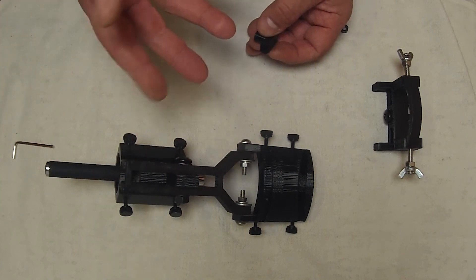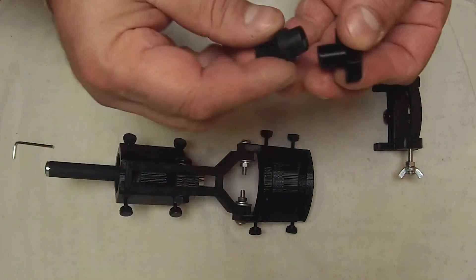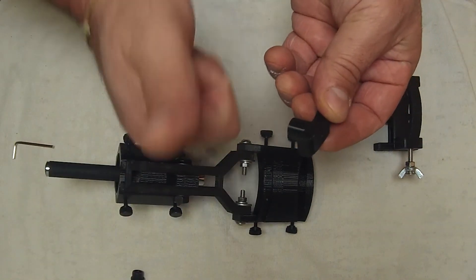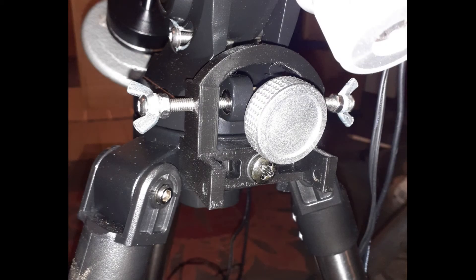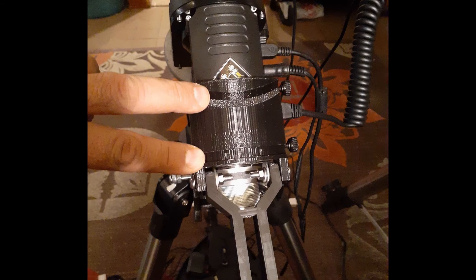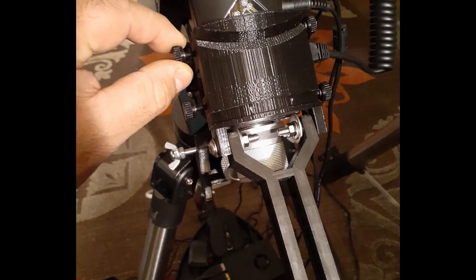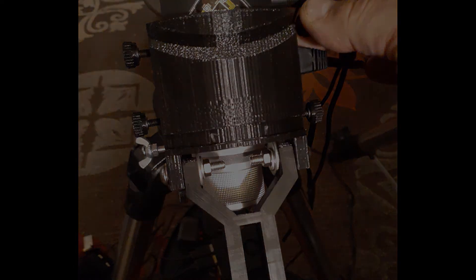There's a stopper for the hole — you can get rid of it. I've included a tiny little plug that will slide right into the front of it, with a little hole in it that you want to get your laser shooting through, which improves your adjustment. So that in conjunction with the azimuth mount 3D print — a couple images of it in place — as well as the top mount 3D print that goes right on the iOaks S100. The zip tie location is visible when it's in place if you choose to use that. I choose to use the set screws, which you can see I'm tightening up left and right, and it's designed to fit around the existing plugs and connectors so it doesn't interfere with them at all.